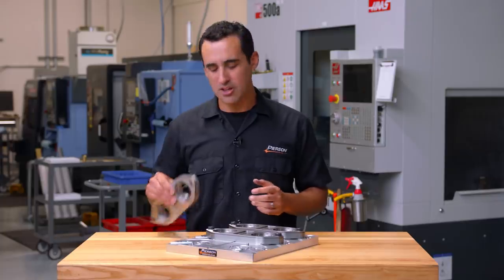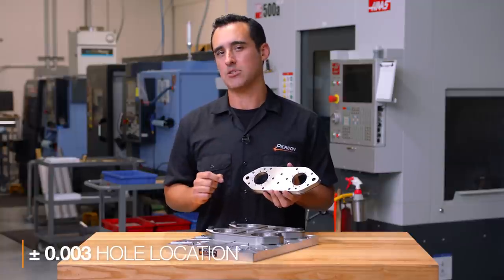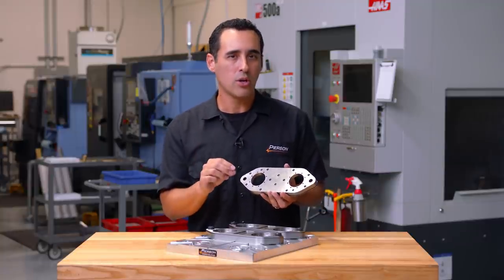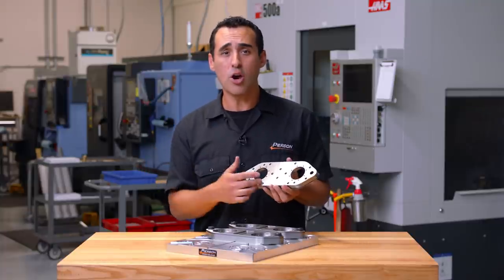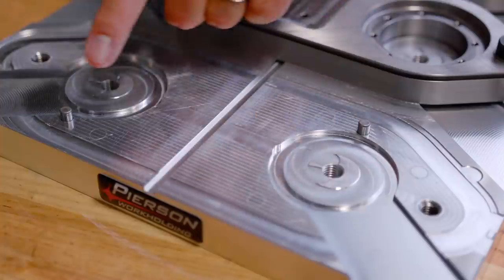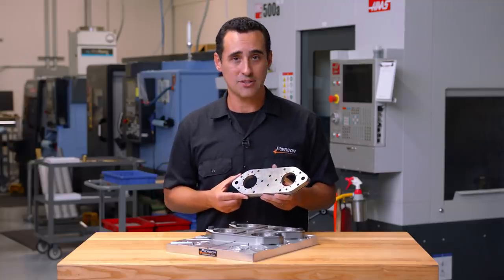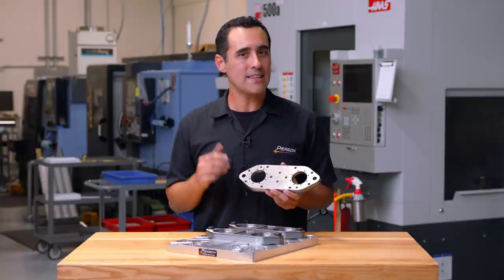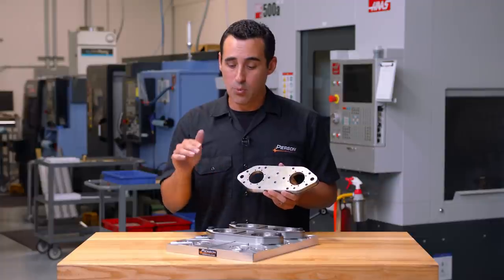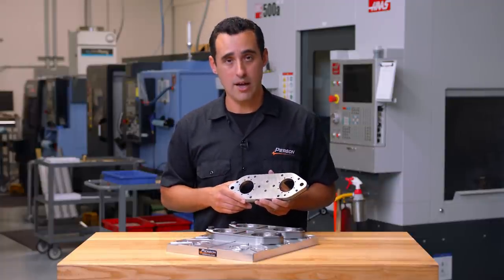We can clamp on that flat edge in op one to add all the drilled and tapped holes. The location of these tapped holes is plus or minus three thousandths, and you should never use a threaded hole or a screw to locate a workpiece. So we add two tooling pins with much closer tolerances and locations. We use these in the alignment during assembly, but for our palletized operations, we can accurately locate it on the pallet.